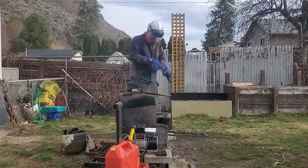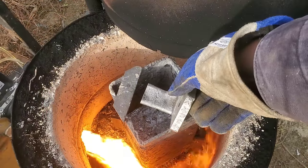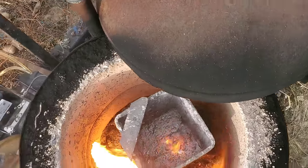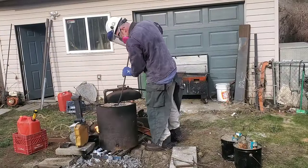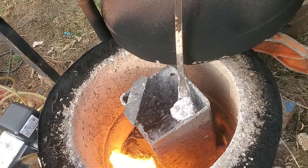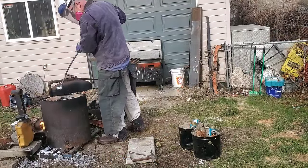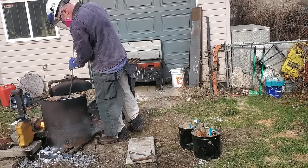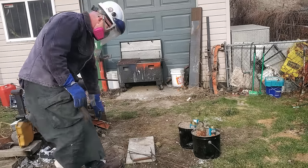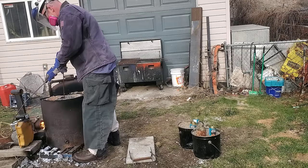The most beautiful thing about this whole process is we can rapid prototype stuff, and if we make any mistakes like I did in my last casting, we can easily throw them into the melting pot and turn it back into another cool part again. My whole foundry isn't really a high-tech thing. The burner is from an old oil-fired furnace, just modified in a couple of little ways. The crucible is essentially just one I welded up out of some big square tubing with a little crossbar and some drilled holes. We're not making space-age parts here, so I'm not really worried about carbon leaching into the aluminum. We're just out here having some fun and making some parts.